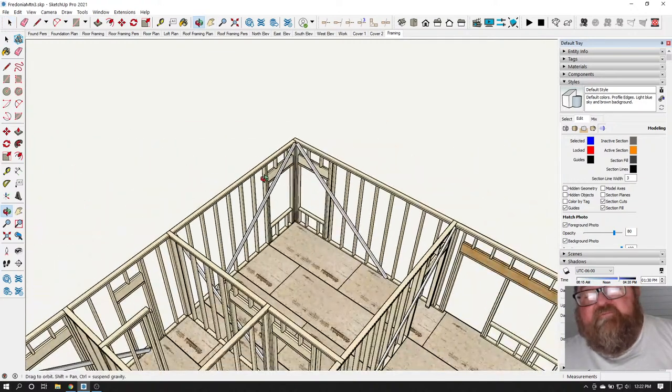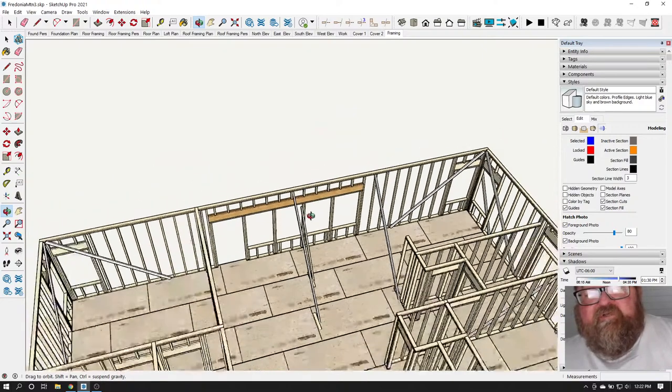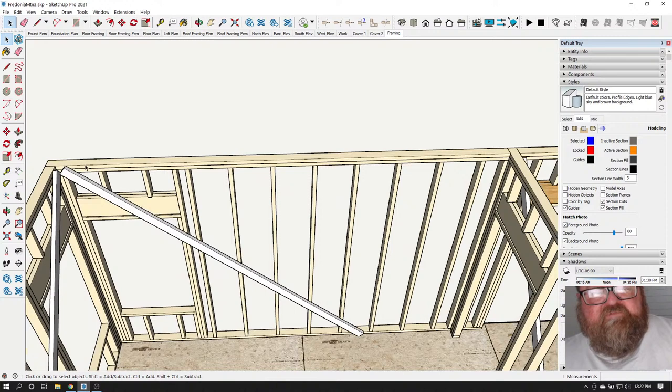You can climb right up those braces if they're nailed — I did that plenty of times in my 20s. Working in this direction, I'm going to knock off the next brace. Really it's not hurting us, but we're getting ready to brace this wall. Take the plumb stick, plumb it in this direction. I've already plumbed it in the other direction — now I lean on it or pull on it, because these walls will rack back and forth easily. Get it perfectly plumb, shoot it at the bottom and in the middle.